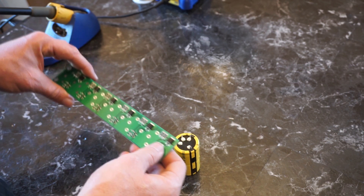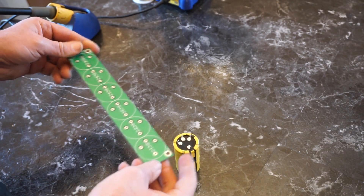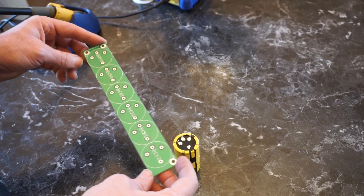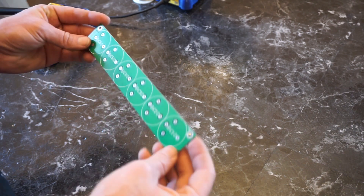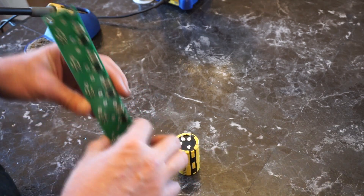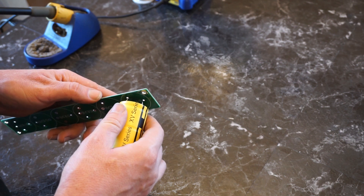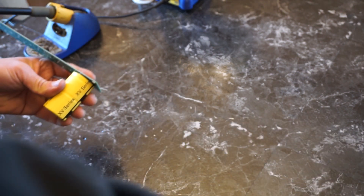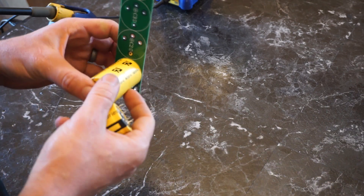These will be great for DIY experimenters who want to experiment with systems like the Solon 1-2000. Later in this video I'll go over the Solon 1-2000 components and how I set them up, so those that want to get a jump start on that project can begin experimenting. The heart of the system are these little capacitor protection boards and these capacitors. Let's go ahead and set this up — these are very easy to assemble. You just put the supercapacitors into the board and note polarity, your positive and negative.